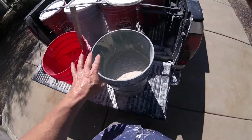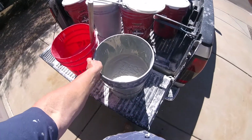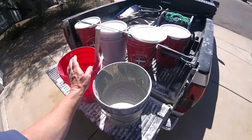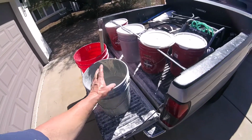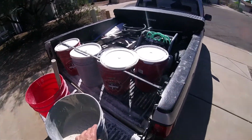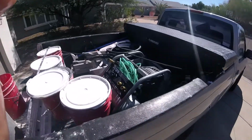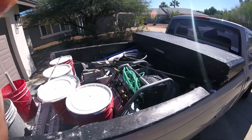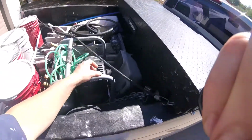box. Keep it capped off with the lid on it. It'll get me through the whole work week with these smaller jobs. Bigger jobs, I'll burn through some mud, but these smaller patch jobs, like this one, we'll probably just need a hopper full of mud. Then I clean up the hopper and move on to the next job. Let's go ahead and get the air compressor set up, get it full of air, get everything checked, locked and loaded, and go spray this wall out.